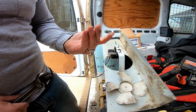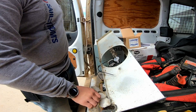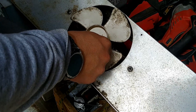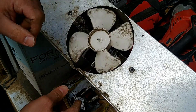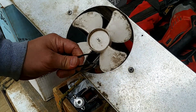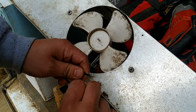We'll stick this in here. If you have a couple of extra nuts, it doesn't hurt to throw them on there just because it helps lock it in place so that it doesn't come loose. Just firmly press the fan blade onto the replacement motor shaft. When you hook up these wires, it doesn't matter which one goes to neutral and which one goes to hot — just have to have them hooked to one or the other.